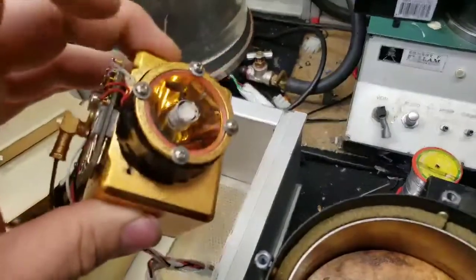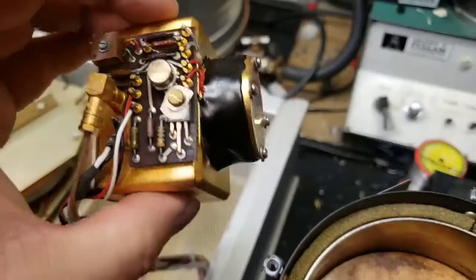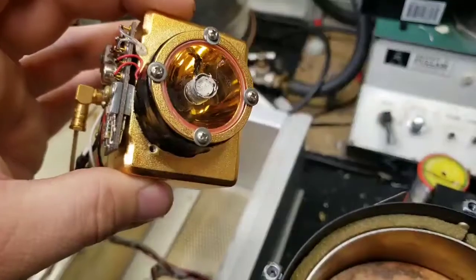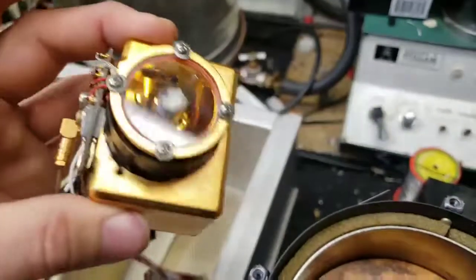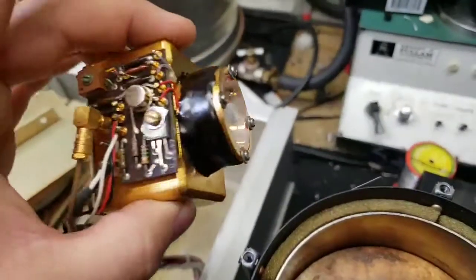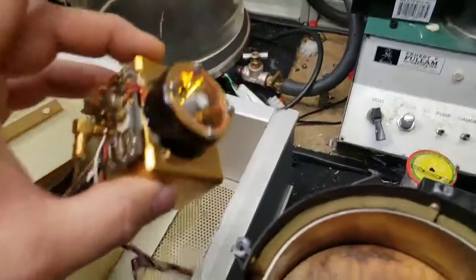Just like a normal lamp, you have a reflector on the outside that would shoot the light out. There's a heater element here to bring it up to about 120 degrees Fahrenheit, which melts the rubidium into a gas and gets it going. So that's the lamp — it emits a rubidium light.